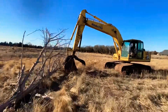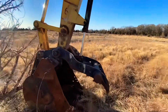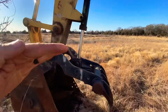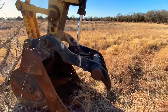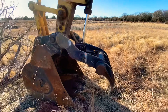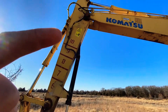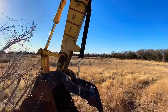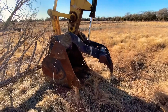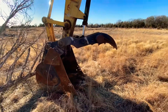The other kind of thumb is a hydraulic thumb. A hydraulic thumb requires auxiliary hydraulics. It looks a lot like the manual thumb, however this is a hydraulic cylinder. You can adjust the angle of the thumb on the fly from in the cab using a foot pedal or fingertip control, depending on what your machine is set up with. The requirements are your machine has auxiliary hydraulics, which are right here — it's where it's hooked up to the hoses. The benefit of that is you're able to move the thumb out of the way without having to use any pins or anything else.